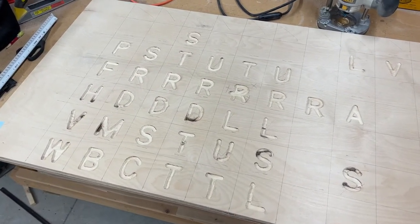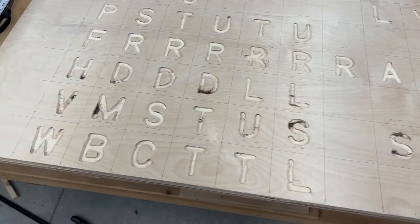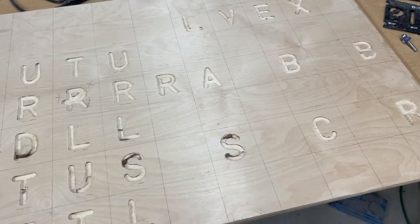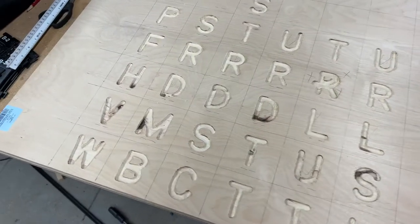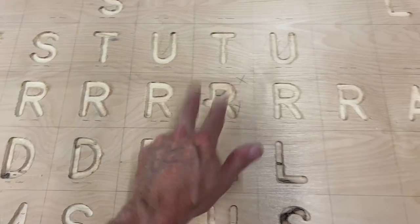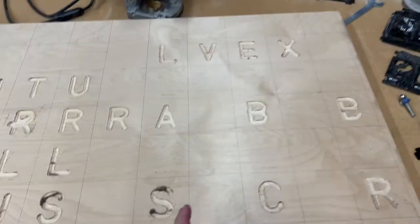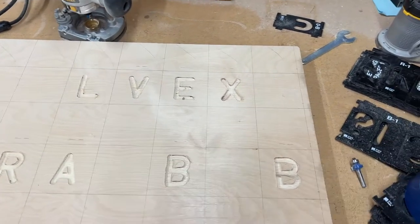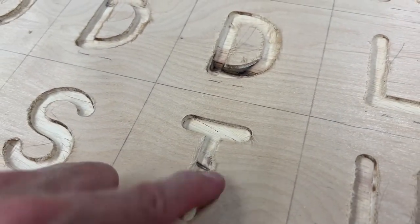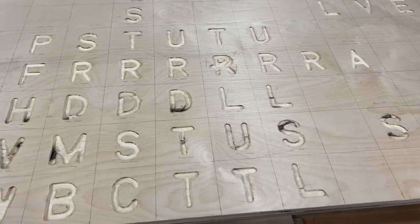So using Jen's template — I'm not sure why the letters were rearranged the way they were. I didn't lay it out exactly as planned, but these are the final two panels. She did like 23 by 23 inch panels and ran them through X-Carve, and I just did two basically two by four sheets of plywood. I tried to reuse some tape and it just wouldn't stick — when I was finishing off that R, the whole template slid on me, so lesson learned on that one. I had plenty of space so I just stuck another R over here. From messing with the sign-making kit, you can see I got a little fuzzy stuff, so basically just a little sandpaper with my finger — etched that all out and it'll come out no problem.